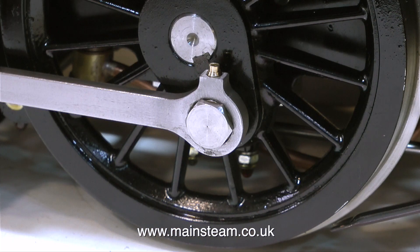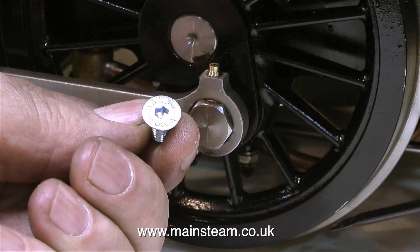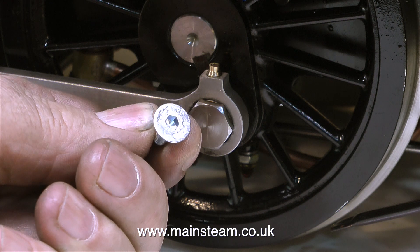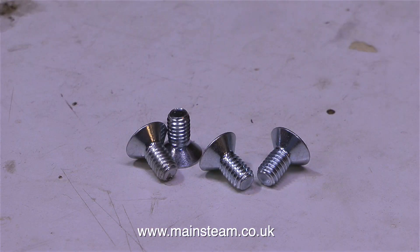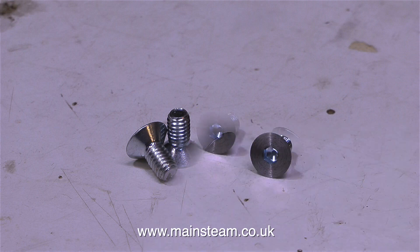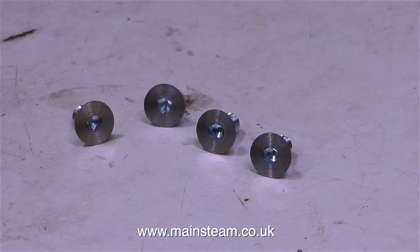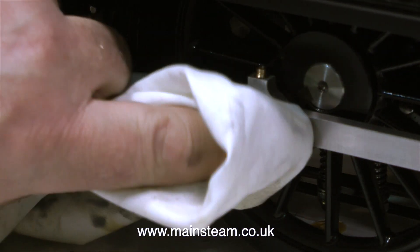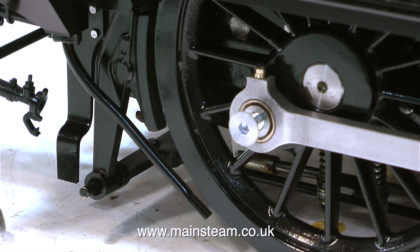Over now to the wheels. I didn't know what to call these, so I called them the coupling rod retainers. Currently the coupling rods are held in place by four massive bolts. I've come up with an idea that I think will work. These are M6 countersunk bolts with a hole in them to take an Allen key, but they have writing on them, so I'm going to machine off the writing. Here are the bolts before and after machining - now they look okay. I just need to fit one in place so you can see what it looks like.